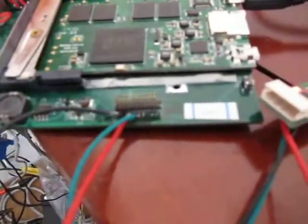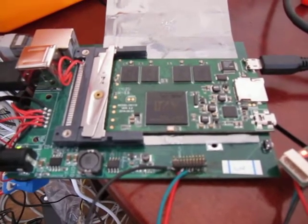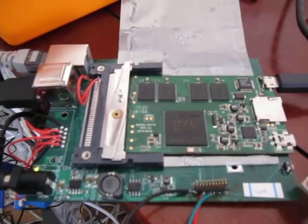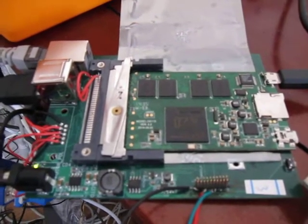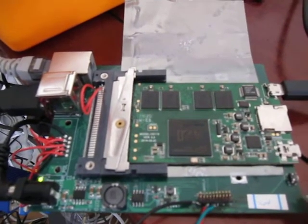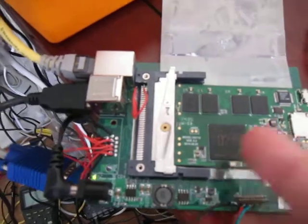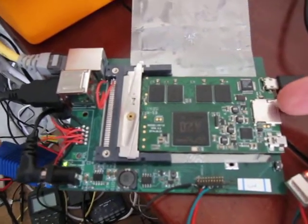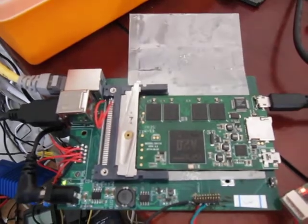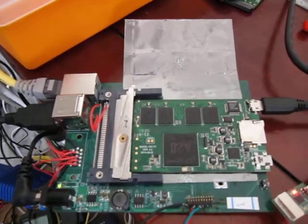On here there is a header. This one here will be replaced. It's 20 pins. It will be replaced by a larger one with 2 millimeter pitch pins. This 1.27 mil is way too small. So there will be, for educational purposes and experimentation, SPI, I squared C, a couple of GPIO pins, PWM, external interrupt, quantity 2, and so on. Here is the EOMA68 identification EEPROM, which, when we get round to writing the software and the kernels, will detect that and go, this is a micro desktop board, therefore it must have a VGA output. I'll just load the device drivers for that.